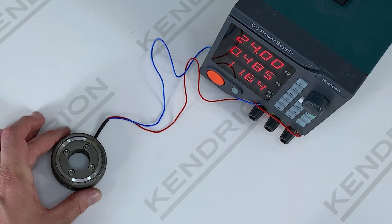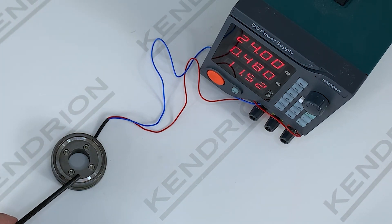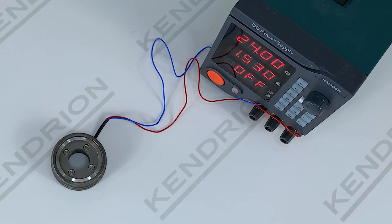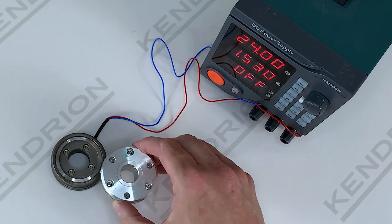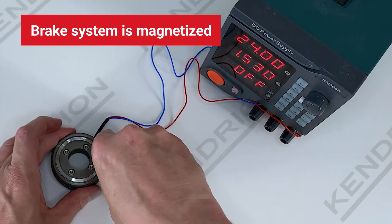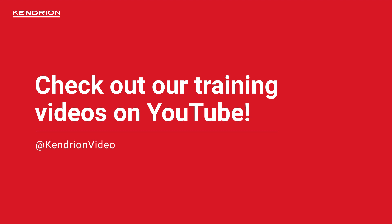Let's switch on the power supply. Through this, we will be cancelling the electromagnetic field of the coil and the brake will open. Power supply is on — and as you can see, I can now remove the armature very easily and it is no longer magnetic. Switching off the power supply again, the magnets are back and they are active. Thank you for watching and listening to this training video. There are other videos providing training material for the concepts of electromagnetic brakes and Kendrion products, so take the time and enhance your knowledge.